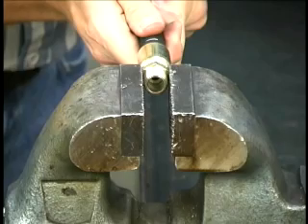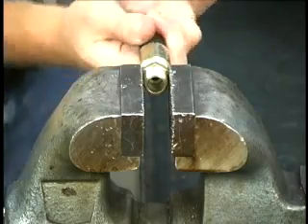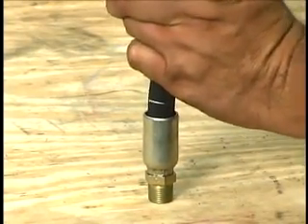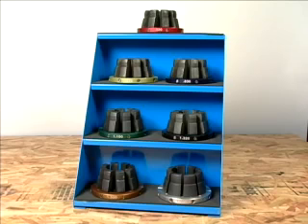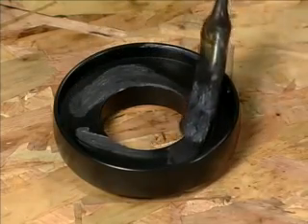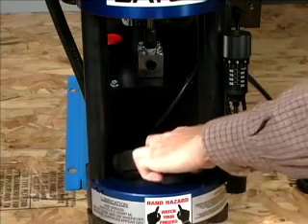Next, the coupling should be fastened securely in a vise and the hose pushed into the coupling with a clockwise twisting motion until the hose bottoms out, at which time the ferrule or shell will have covered the mark on the hose. If a vise isn't available, the coupling can be pushed against any material that is softer than brass. To set up the machine for the crimp, identify the correct die set using the crimp specs in the DECO Hydraulics Catalog. You will need the .670 yellow die. Lubricate the pressure plate with the EasyCrimp M High Pressure Grease or its equivalent. This is the only grease approved by DECO for the D165DC crimper. Insert the pressure plate into the aluminum base.